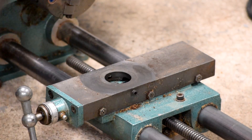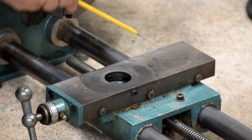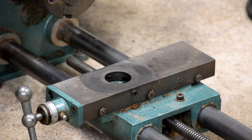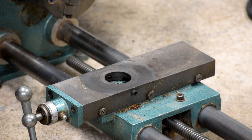What I'm going to wind up doing is machining a spacer to fit in here that clamps it down, and then there'll be another spacer that sits on top and a standard wedge-style quick-change tool post will fit on there. I don't need the compound anymore, but I do need a way to make sure that every tool has the same length every time, because I don't want to be resetting tool length every time I change tools for a CNC program. A minor thing but fairly straightforward to make happen.